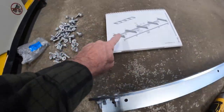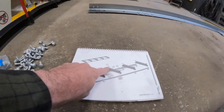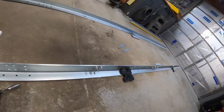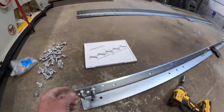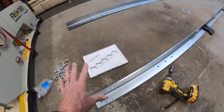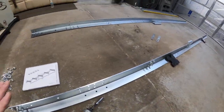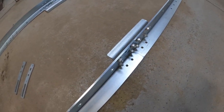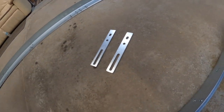I put the carriage bolts in from underneath because I need to put these crossbars in next. I put some weights on it and ran all the bolts in, tightening down with my fingers. I'll do the same for this side, then flip them down flat, loosen them up, put the middle pieces on and go for it. The middle braces have these pieces that came wrapped together.